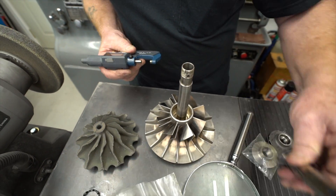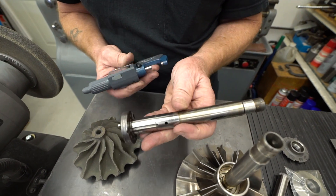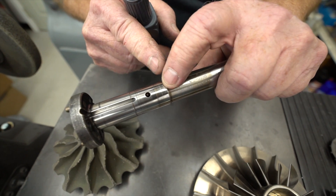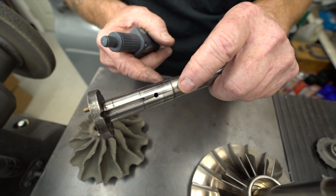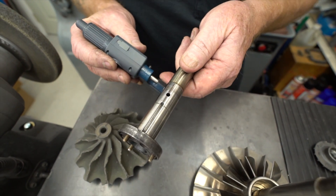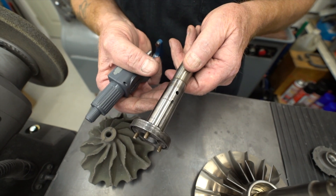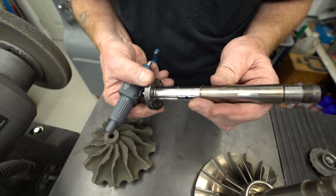On the bearing — the high-speed roller bearing — this is a shaft with everything stripped off it. You'll see the little wear area; that's where the roller bearing runs. This is harder than the rest of the shaft, at Rockwell 68 to 72 on the C scale, which is pretty hard. These run from 7733 to 7737. We get bearings that are made in different sizes, so we have a couple of tenths clearance all the way around the shaft with the bearing.